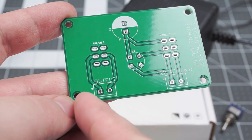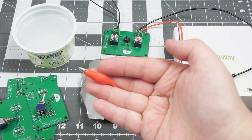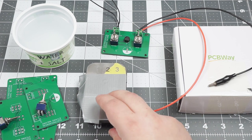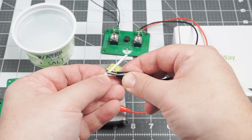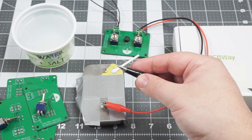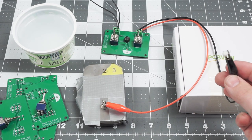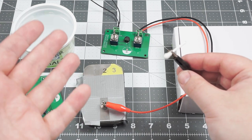I have one of these circuits already soldered and I'm almost ready to do some etching. The positive output wire goes to the object you want to etch. Negative goes to the crocodile clip connected to, for example, a Q-tip. You could also use, for example, a small bolt with one end covered with a cotton pad. The Q-tip should be dipped in an electrolyte solution. There are commercial electrolytes, but I haven't tried any.